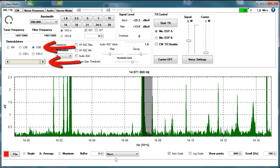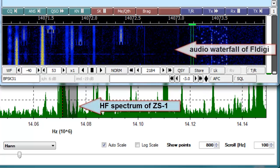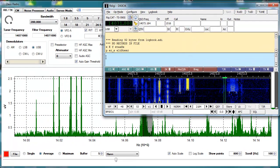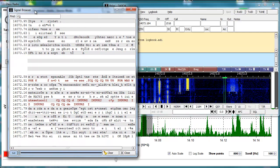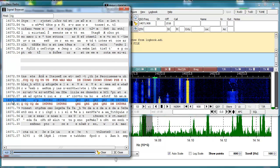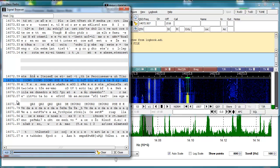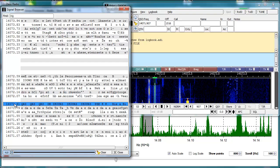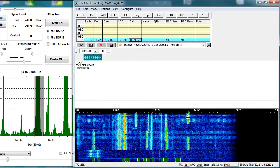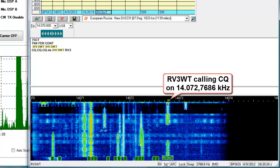It is a preferred strategy to work with just one software for controlling the receiver, coding and decoding. I will show it with PSK31 as an example. Set the transceiver to SSB and to its broadest bandwidth. Its audio will appear in the waterfall window of the multi-mode software. You can click onto each and every signal and the software will decode it. The most valuable are multi-channel decoders — they decode all signals of one mode within the audio bandwidth in parallel. A click onto an entry takes you right to the correct frequency. Even for transmitting, you need not change the transmitter's frequency. This is done automatically because the multi-mode software chooses the matching audio frequency for modulating the transceiver. So you automatically are right on the spot.